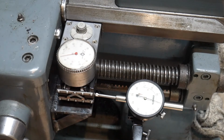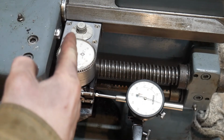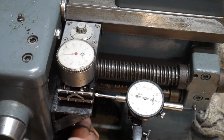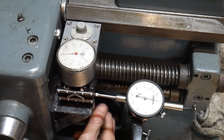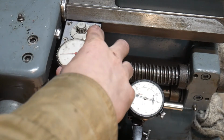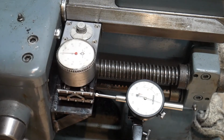So I see that the needle is to the left. So I'm going to tip it to the left by tightening this a hair and loosening this a hair. Touch tighter. And then loosen this by a roughly equivalent amount. 0 these. 0. 0. Great. And now it's a little to the right by 1 thou.